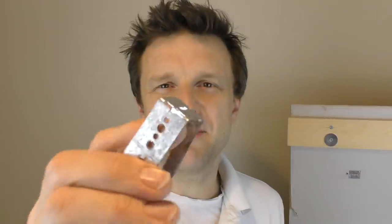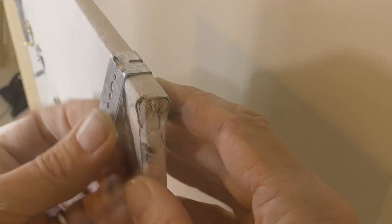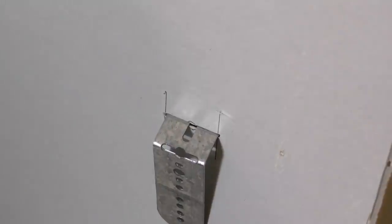By the time I finished my tenth Blade Fixer I pretty much perfected the art of cutting the hole and inserting it. In a lot of instruction videos you're recommended to bend it around your finger, but when using 12mm plasterboard you end up with a Blade Fixer that is much thicker than the plasterboard — this one I bent around my finger is about 18 to 20 millimeters now. I found it was much neater when I bent the fixer to the depth of the plasterboard itself, though that does make it slightly more difficult to insert.